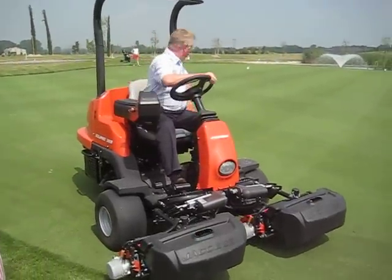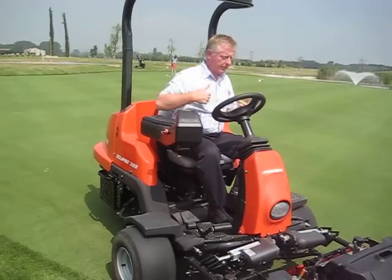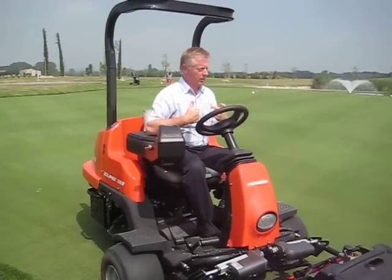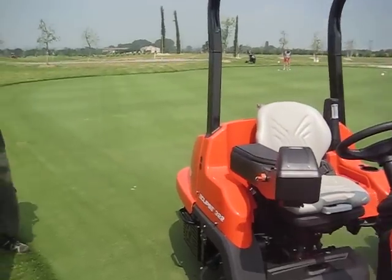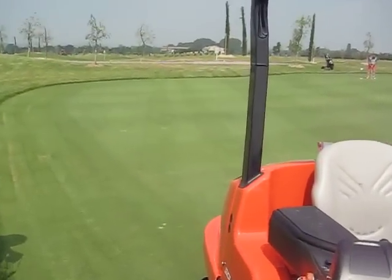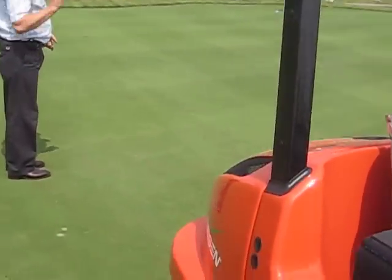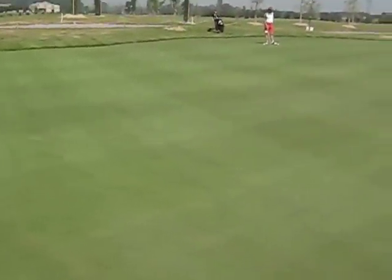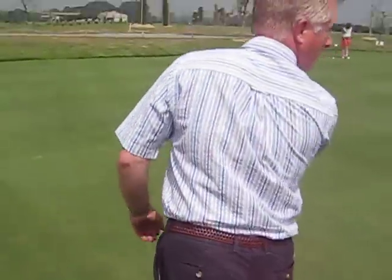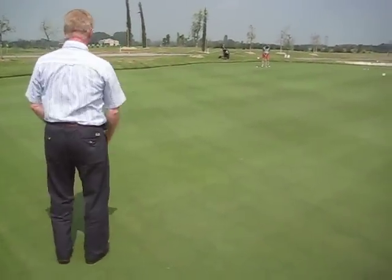That last track looks like a hand mower, and that's because we lifted the centre unit and dropped the two outer units. So when you look back, this is a tri-flex obviously — and this could be a hand mower, couldn't it? With a little bit of skill, when you turn around you drop this mower into the unmowed track and then the outside mower will drop in.